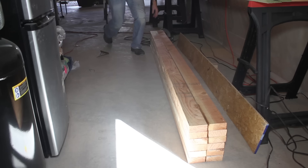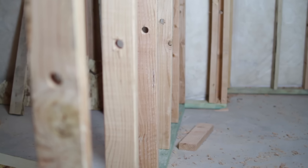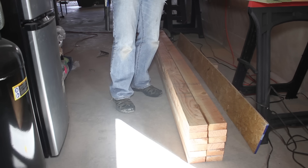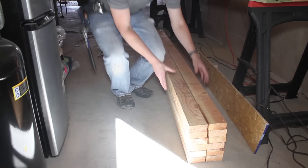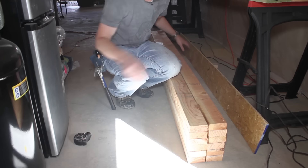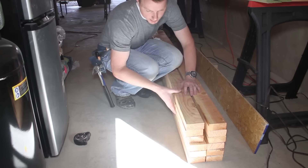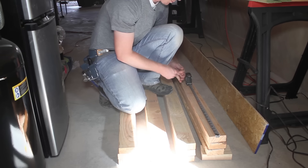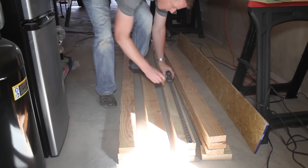While these are lying down, let's go ahead and get the holes drilled. You can see I've got holes drilled about two feet up on all the studs in the framing I've done so far. What that does is make it so that when you put your outlets in about one foot up off the ground, your wiring is all ready to go — you can just feed the wires through, put the outlets on, and connect it up. I'm going to cut this pile into sets of three. The nice thing about these holes is the measurements don't have to be exact — they want to be pretty close, but if they're off an inch or so that's really not going to be a big deal.